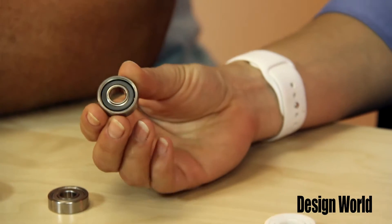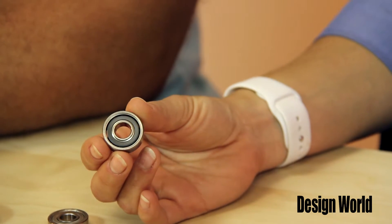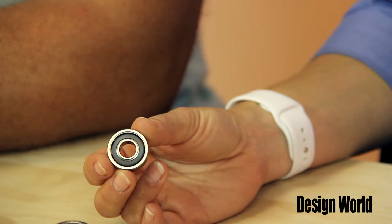Next, we have a YS-type bearing with ball spacers made of a lubricating-sintered alloy, this one here. With an operating temperature to 350 degrees Celsius, typical applications for the YS bearing are in sputtering equipment for semiconductor manufacturing and vacuum deposition equipment. Compared to bearings with conventional high-temperature solid lubricants, the YS bearing extends operating life by more than tenfold.